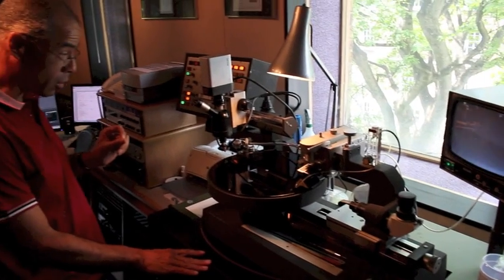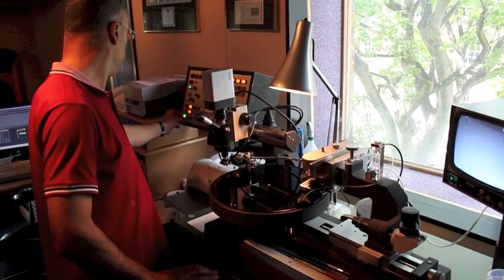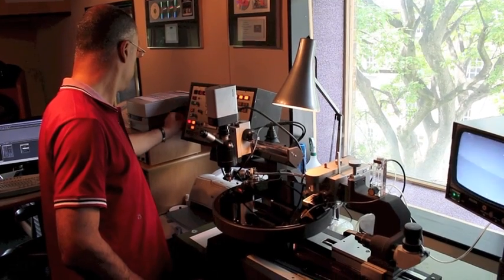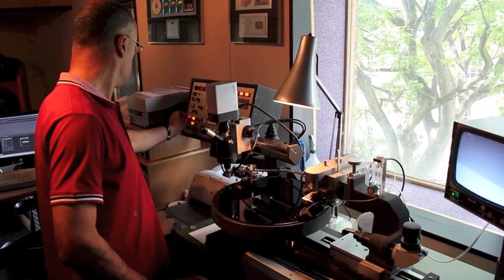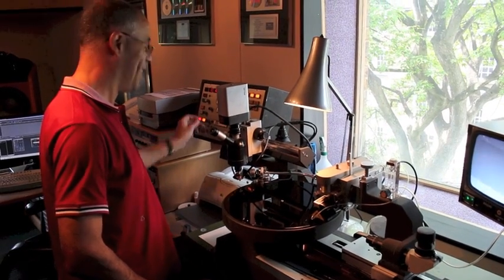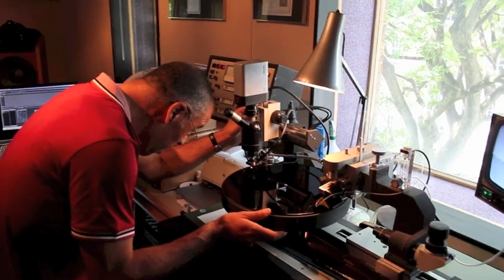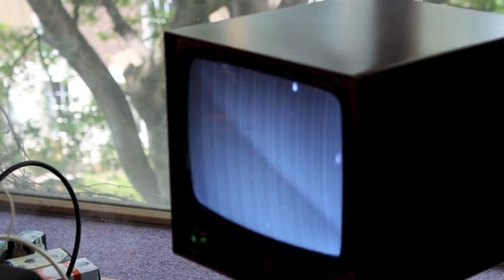Right, small test cut, silent grooves — that looks nice. I'm going to have a look in the microscope just to see how they're not touching, or any stylus aberrations. You can also see some grooves on the TV there. About the width of a hair on your head — 50 microns.